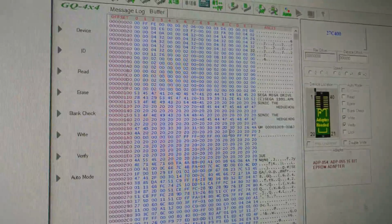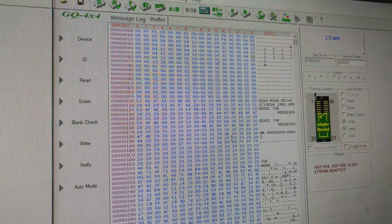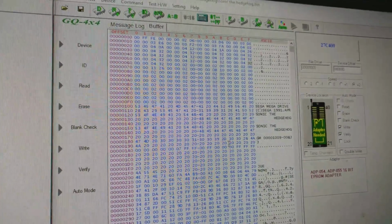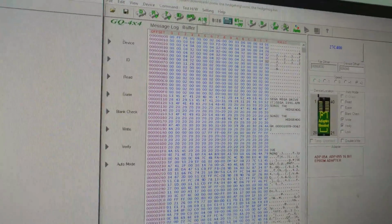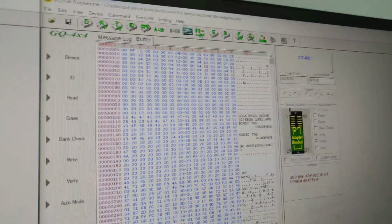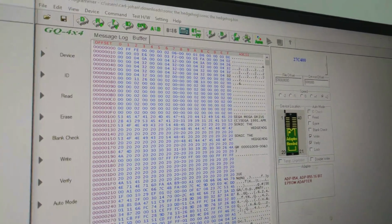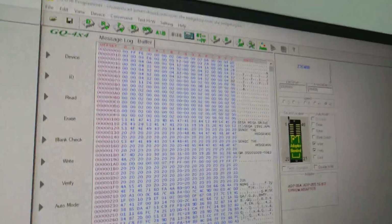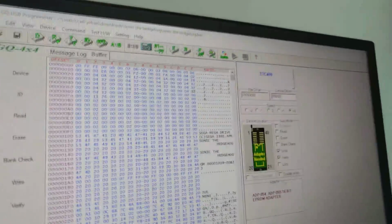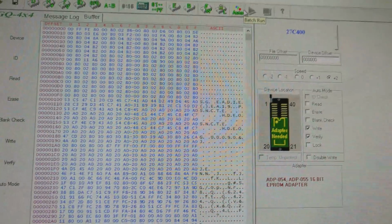So if we look at the hex code and compare it, what I noticed is that in position 0 it says 00, let's just do a byte swap over here. So then we got the same position. Not position 0, position 1. It says FF00000000 all the way down, then 45, 43, 4F, 20, and so on.